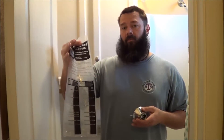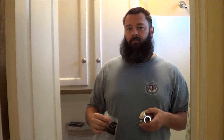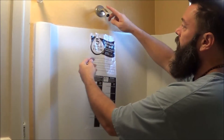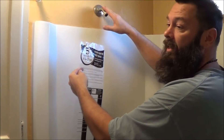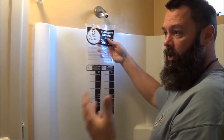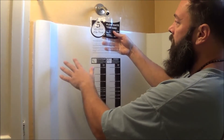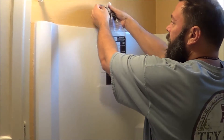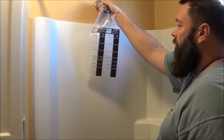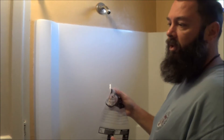You do need a helper to help you turn the water off and on every five seconds, because you have to keep this enclosed around the faucet head to minimize how much water you spill. On the five-second flow test bag, we're going to have a control — meaning there's nothing at all on the shower head. We're going to run it for five seconds to see how much water can go through with absolutely no restriction.